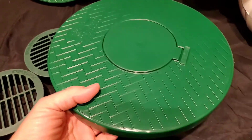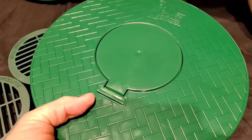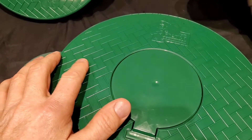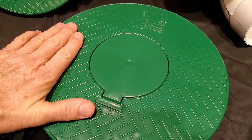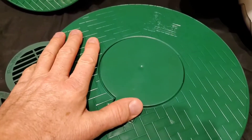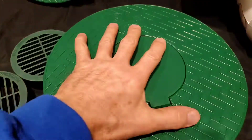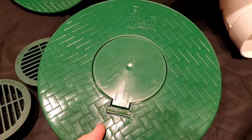Here it is in the pop-up form. I wanted a pop-up that had a really nice big turf restrictor plate — I think three and three-eighths inches all the way around — so the grass can grow up on this plate and not grow over your discharge. That means you're not going to end up with a flooded basement, flooded yard, flooded crawl space, or flooded garage. The grass is going to get up on this plate, and it's super easy.